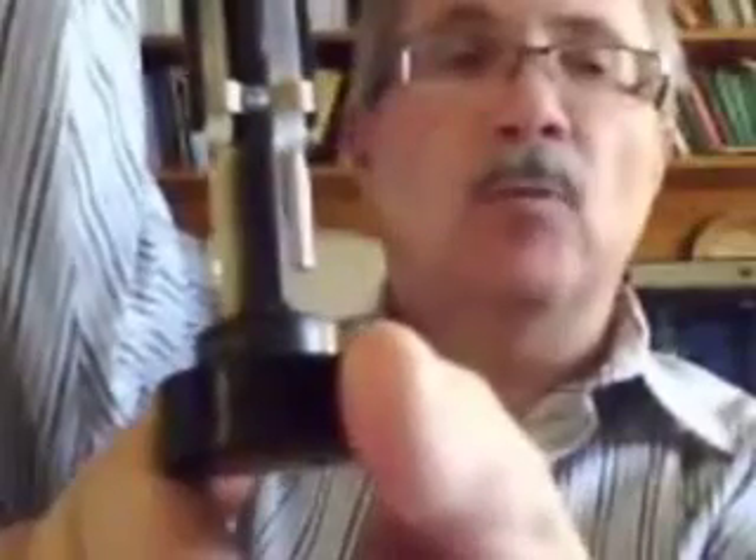One of the tools that we can use in a greenhouse to determine wet bulb temperature and use it to calculate relative humidity is a sling psychrometer. This is an old device but still very accurate. The one that I'm showing you here on the screen is a barrel with two thermometers mounted inside. It has a cotton sock that's been saturated with water on one side and a bare open bulb on the other side.